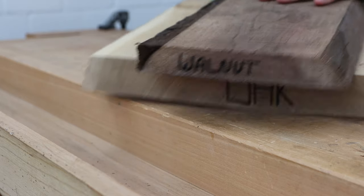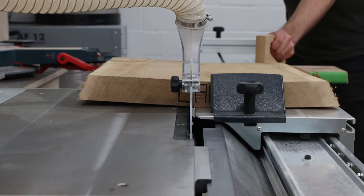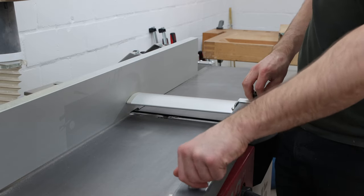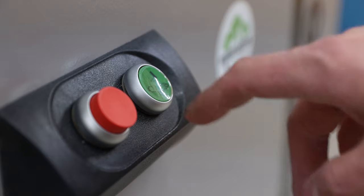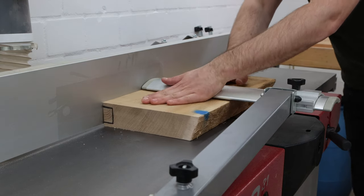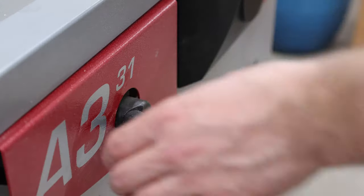For the shelf board itself I used 52 millimeter live edge oak, and for the key chains, walnut. After mounting the edging shoe to the sliding table I ripped the oak board to width. Then I moved over to the jointer and set the guard to the suitable height — this is one of the most critical parts for me of staying safe at the jointer. After jointing I made the conversion from jointer to planer.